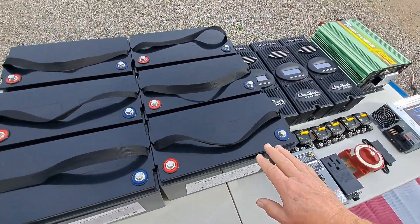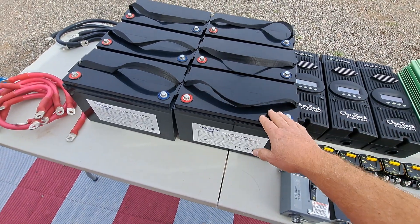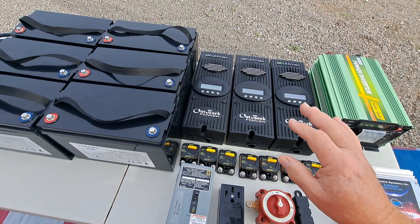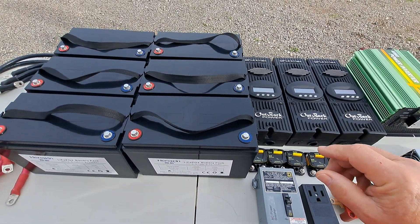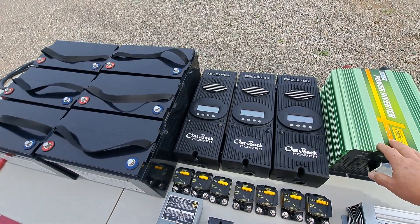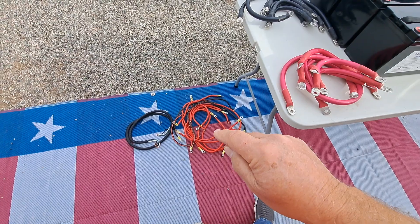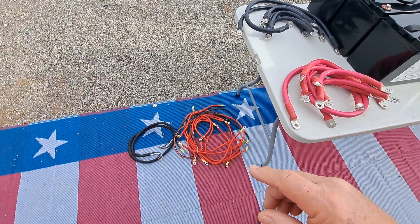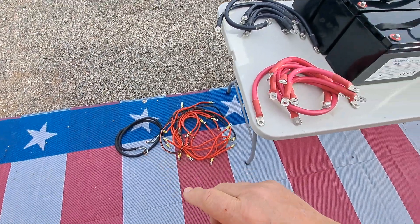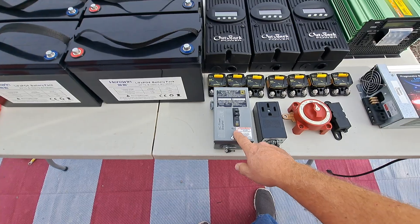There's enough cable here to run from the battery to the disconnect and then over to the inverter. The same for the negative side of the system — from the batteries they would run to a shunt. I have a battery monitoring system ran to that shunt, and then from the shunt it would go to the inverter. These cables here are the cables that would run from the individual charge controller to the battery, from the battery charger to the batteries, and then that cable right there is the cable that I used to run from the inverter output to the 30 amp circuit breaker.